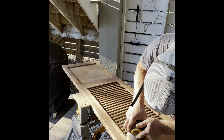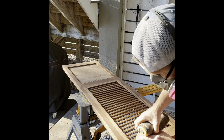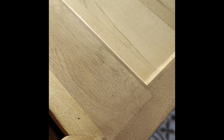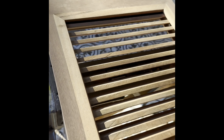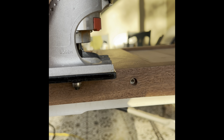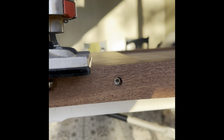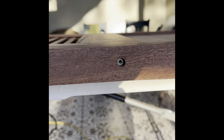Putting it in fast-paced mode — start with the belt sander, then go to the palm. Finished up with the sanding, really pleased how it looks: nice tight corners, you can see where the different woods are combining with a nice smooth transition, all the seams are tight. On to the last step: routing the edge, just a simple round-over bit for the edge, and we're done.